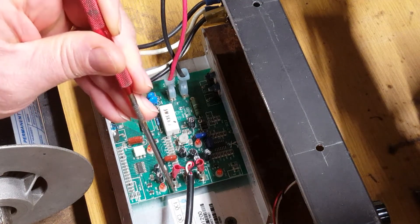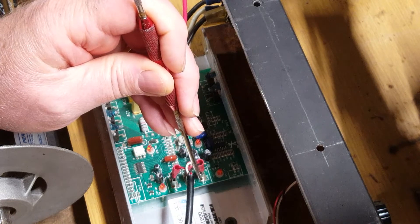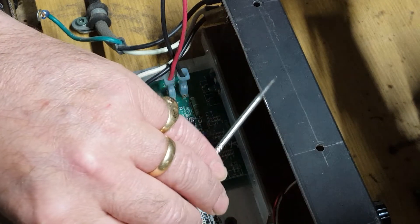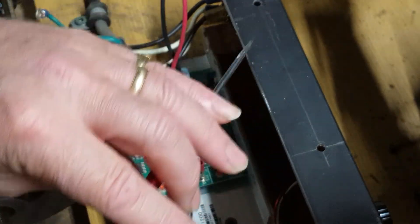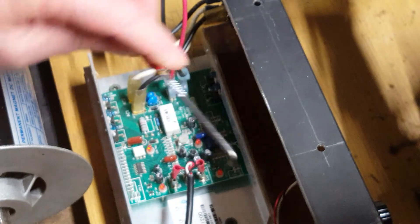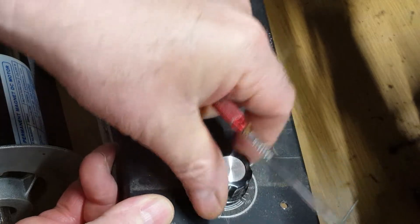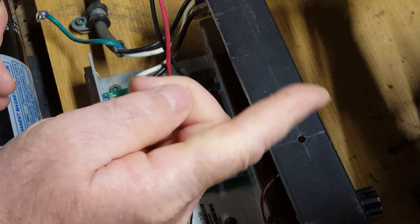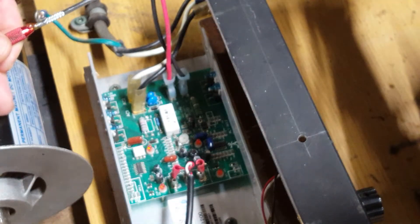The wiper is the variable portion. From zero through to the high side you're sweeping a lever around, which is changing the resistance being output from the potentiometer to the board as a voltage. So you get a voltage difference. When you turn the potentiometer — sorry, the rheostat — you're actually sweeping an arm in an arc around a wire, changing the resistance and theoretically giving a different voltage output. That's the variable portion of the drive.